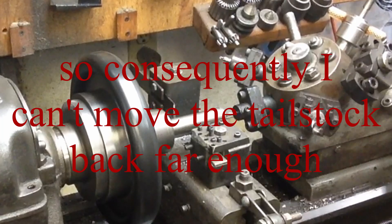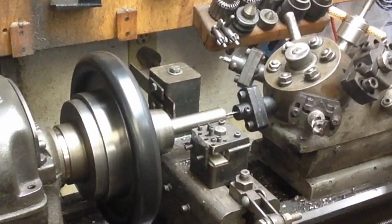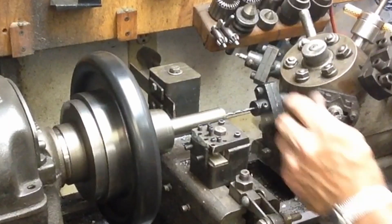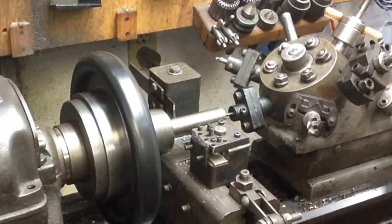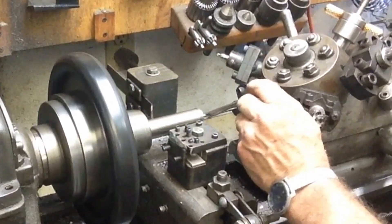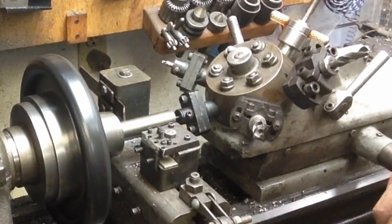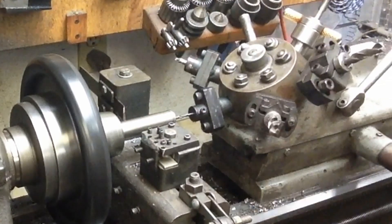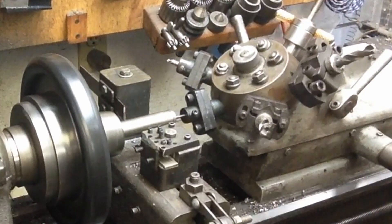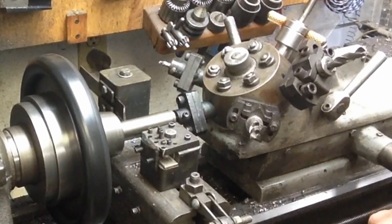Since I've got the other shell lathe, I'm assuming this one is going to be set up permanently as a turret lathe just for operations like this. What's happened with this tailstock is I've got it set too close to the headstock for where the stock is. Consequently I've got the stops in some cases completely bottomed out. If you look at the handle on the right hand side of the screen on the tailstock, every time I retract the turret you'll see that handle start to move — it's actually releasing the turret. There's not enough room to get that tailstock back far enough, and that's an issue throughout the whole setup.